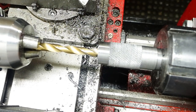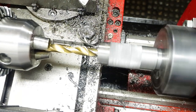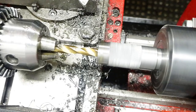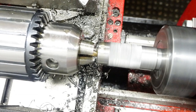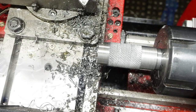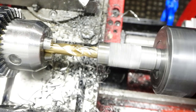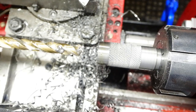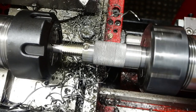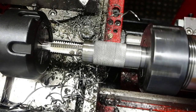I think this was 6mm first to try and preserve a straight hole, right the way through as long as it will go, followed up with the 8.5mm. Now this tapping exercise here is really to get the thread established in the hole and to get it established straight.